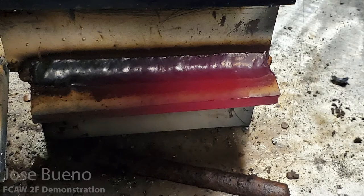That's pretty much it for our demonstration for flux core arc welding. But before letting you go, I want to include this image just to emphasize the temperatures involved with flux core arc welding. This is on half-inch plate — this is what happened while I was dialing in my settings, after one single pass on a T-joint. You can see how red this plate is after just one single pass, which shows you how hot this metal gets with flux core arc welding. So keeping that in mind, make sure you have the appropriate gloves to protect yourself. I'll see you in the next video.